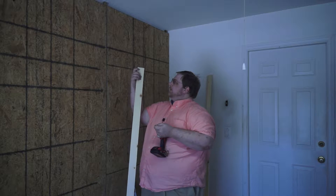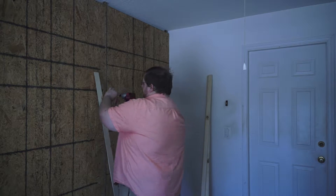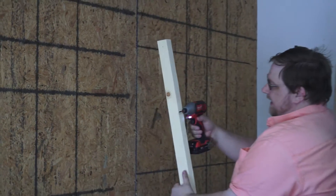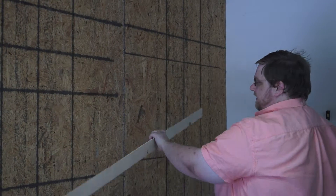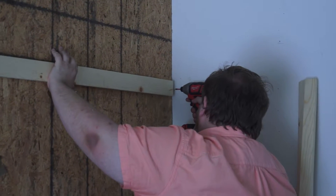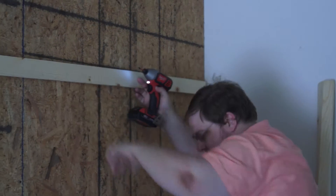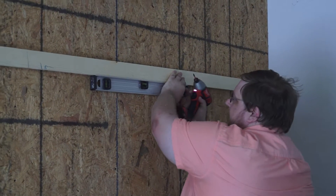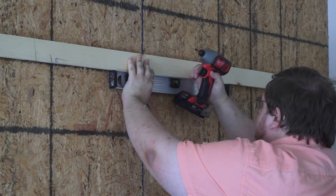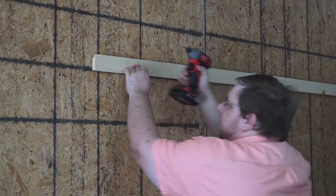I got my board here, went ahead and pre-drilled. What I'm gonna do now is take a screw, get it started in the hole just so we have a little bit to hold on to — makes it a little bit easier. The part that has the 45 cut is going up against the wall. I'll come over to approximately where I want it and screw in one side. Then I'm gonna take my level on the bottom here and get it as level as possible, which is pretty important because of the way the French cleat system works.